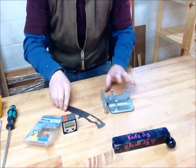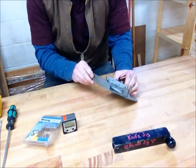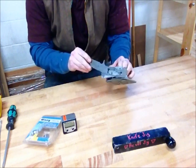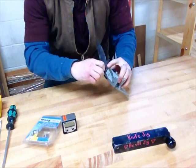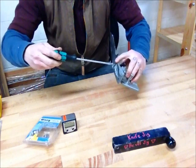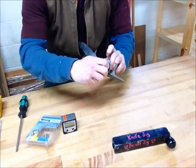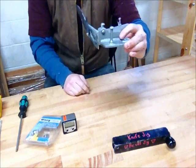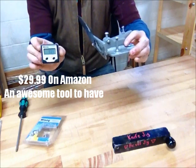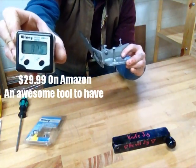So I'll show you guys how it works. You take your knife and, since this one tilts forward, you don't need to tilt your belt sander table at all. You slide it into the skeletonized handle — you have to drill a couple holes in your blade to be able to hold it. Tighten that one down, tighten this one down, and set it on your belt sander table. I use the Wixey digital angle gauge — it works really well.